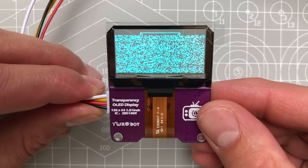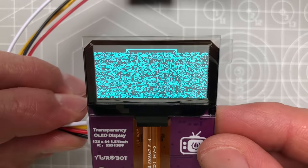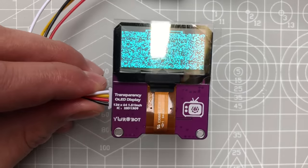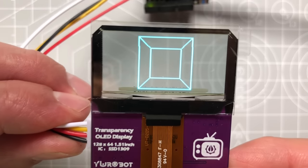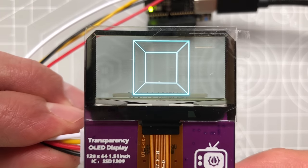What's not so great is the appearance on the display. The first 8 or so lines are fine but then there's a mess. By trial and error I found that trying to set the fast I2C connection is causing the issue — it's not working for my combination of board and display. If I remove it from the initialization procedure it works just fine, and it looks exactly how it's supposed to.